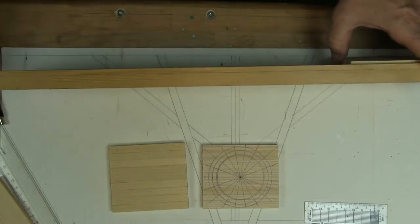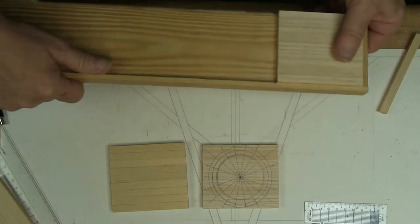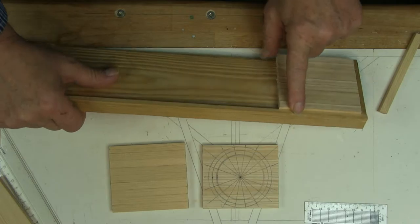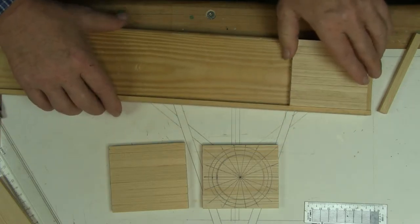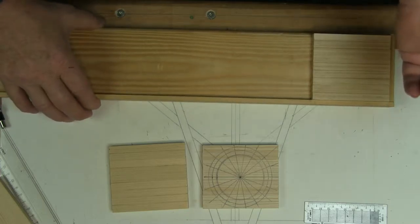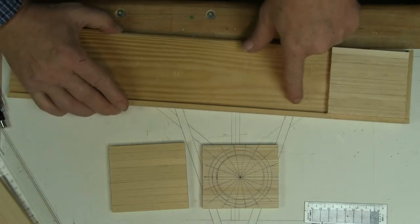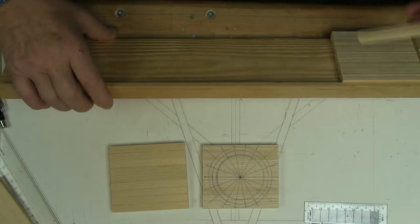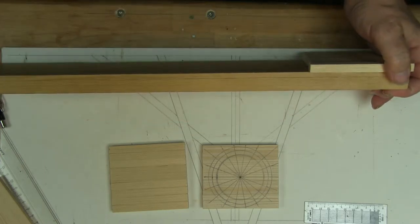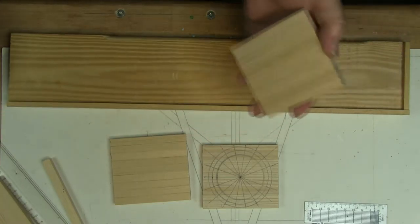You know, when you start with problems, you're always afraid you get more. I will take this. See, as I said yesterday, now this is stuck to here because I have glued it. I have been careful with the glue, but still it's stuck on the board here. To get it off, don't try to jam something under and take it off that way. You take a piece of stick you don't use, and because you have glued it up against this lip, this small stick, you put this one on top of that, and then you take a persuader, and so it's off without breaking anything apart.